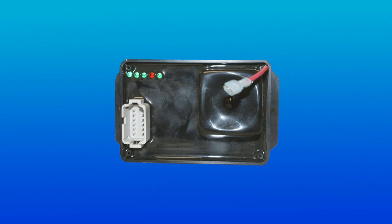The fault flash patterns of the red LED are as follows: one flash — high valve output shorted to 12 volts; two flashes — high valve output over current or shorted to ground; three flashes — low valve output shorted to 12 volts; four flashes — low valve output over current or shorted to ground.